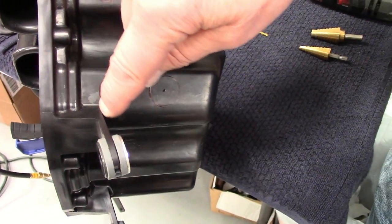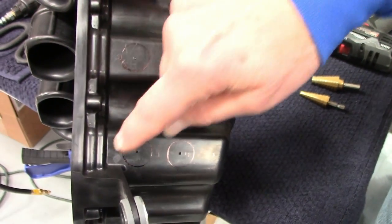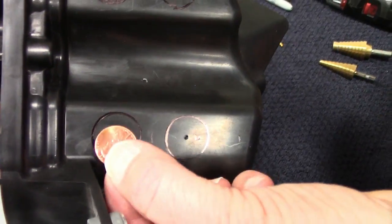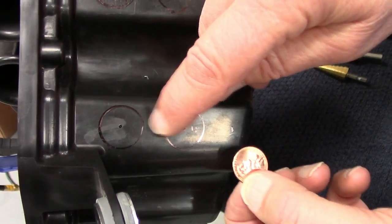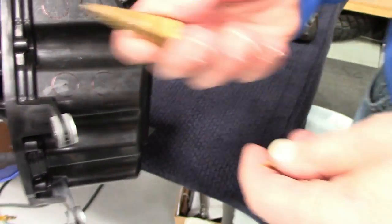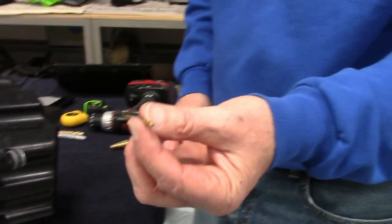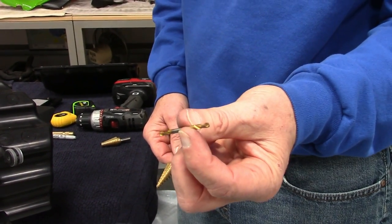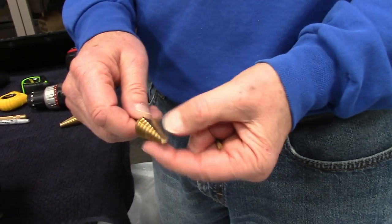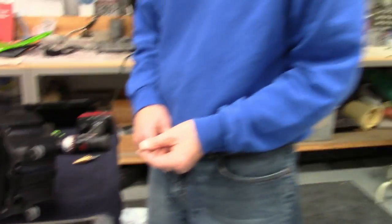On the front one here, I want to keep below this little mounting brace. A quarter inch below the edge, about a half inch gap - I want to keep that support. Now you're going to use a step drill bit. This one is only up to three-quarter, so you can go one step at a time. I want to use a brand new eighth inch drill bit for your pilot hole - that way this thing hopefully gets started centered and the hole will be centered. Let me get those drilled and I'll show you.